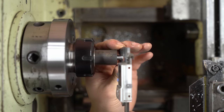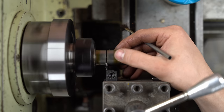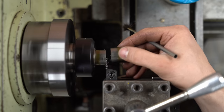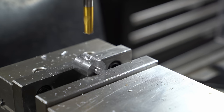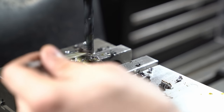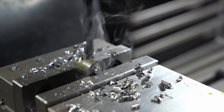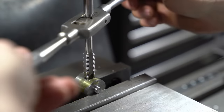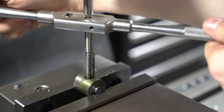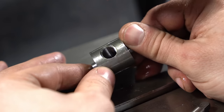I'm finding this ruby stone quite useful for taking off tiny amounts if I've turned something oversize. Two of these knuckles are drilled and tapped M12 for the lead screw to pass through. They're countersunk of course, which helps the tap go. I'm using the pointer in the collet chuck as a tap follower again. Those threads came out nice and cleanly — this is 12L14 steel, which works really easily.